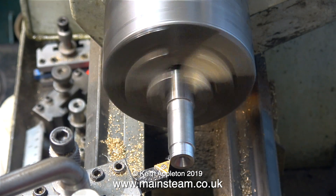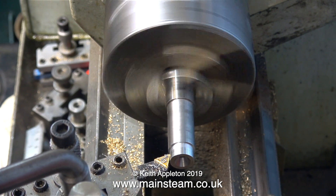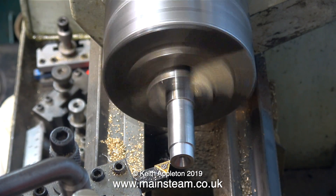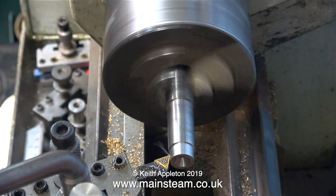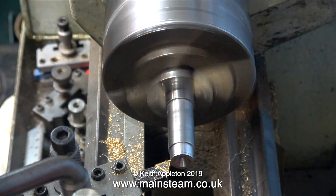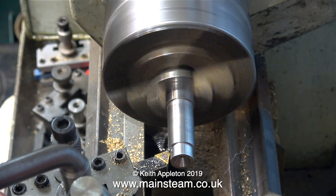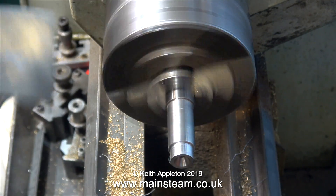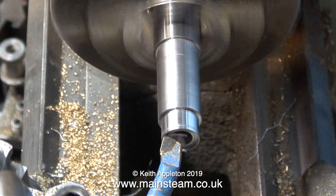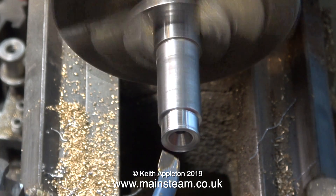So I think it's a good idea to show how to make your own hole punchers. I need to punch a really nice clean hole which is 9/16ths of an inch in diameter, and because I'm making two of these engines, I need to punch a total of four holes. I've fitted a piece of steel bar from my scrap box into the three-jaw chuck in my Boxford lathe. It's very simple to make, and the end of the bar's already been drilled. I'm using a boring tool from the inside to outside at an angle, which will give a very fine, razor-sharp edge.